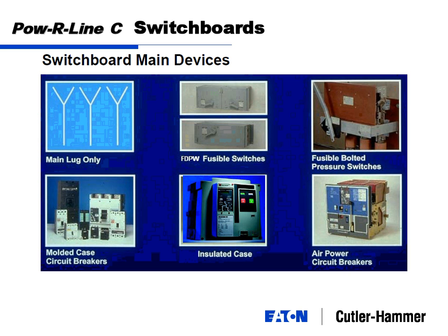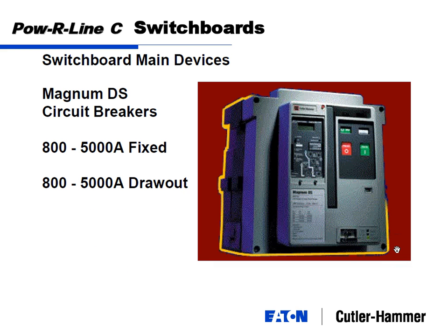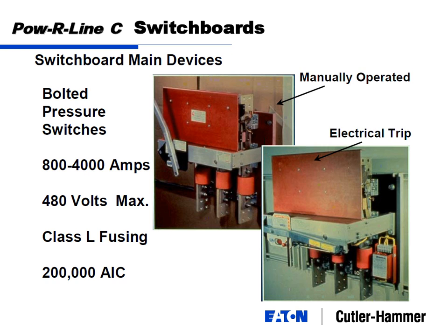The insulated case breaker is really tested and built to the same standards as a molded case breaker. But you get the ability of the two-step stored energy device, which is being able to open and close it remotely. Can you do that through a computer? Yes. Basically, any dry contact.